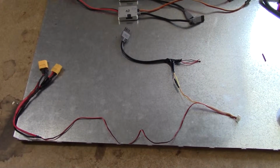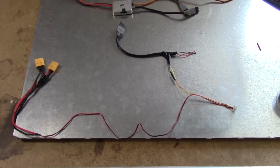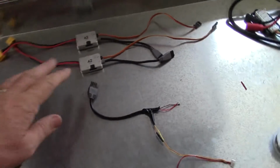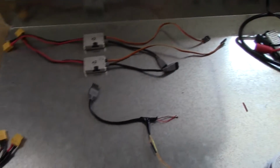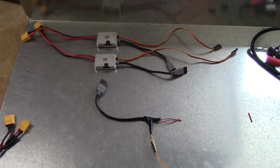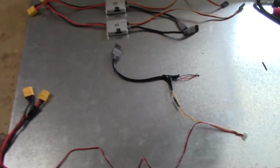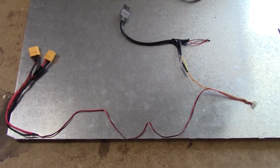I recently had an issue with my S1000 where I plugged in the battery and all of a sudden my PMU began getting very, very hot. I lost the LED, got a couple of flashes of yellow, and my equipment went down. This was just before takeoff, and I had done about 3 flights just prior to this incident.